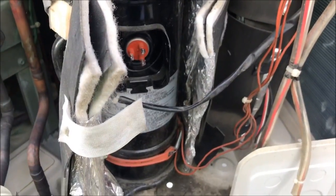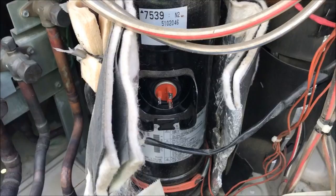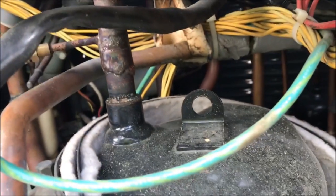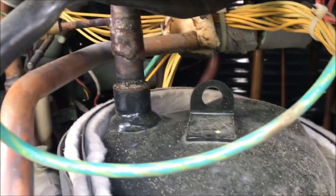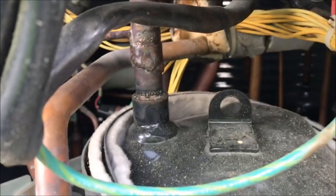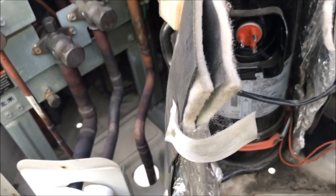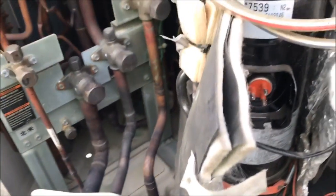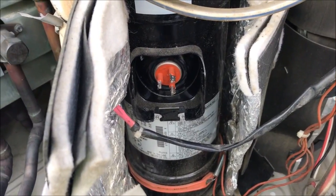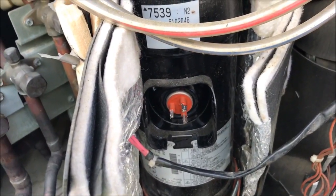And they have found out, because we had discussed with the company why are we having so many bearing failures in certain areas, and this has been replaced once before, about 3 years ago. It's got a stem on it. That's one way you can tell. That's a bleeder stem, so the refrigerant pressure doesn't build up. That and the weld on there, you can tell by that weld. But anyway, we asked about all these failures, and we were told, even though you have piping practices you have to follow, they can't babysit the installers when they put this stuff in.